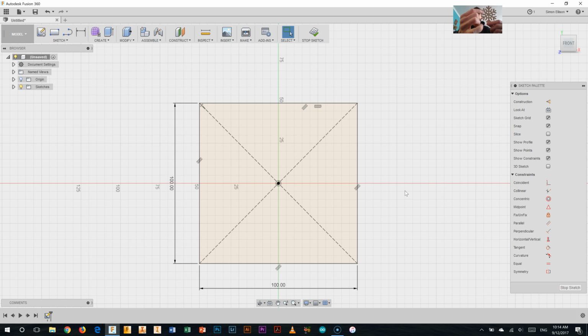Alright, the snowflake itself, like with any snow object, it's rotating around that middle point. So we're going to use what's called a pattern, a circular pattern very soon. So to start off with, I need to divide 360 degrees, which is the full circle, into a 1/6. And if I do that, I get the following. 60 degrees. So that's where I need to start.